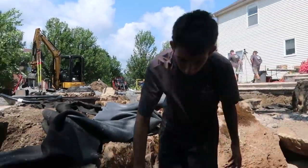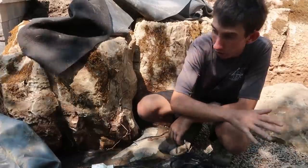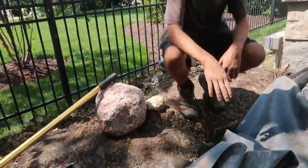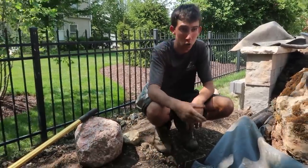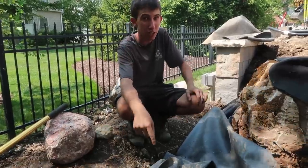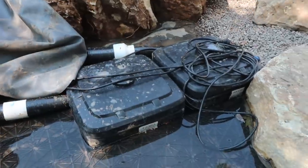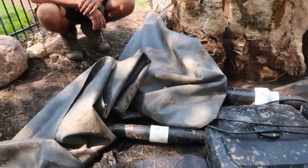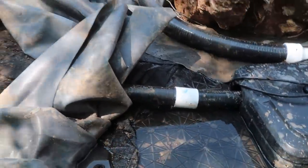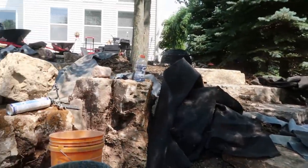Right here you can see our pumps are housed — we have two pondless vaults. We're going to come through here and cobble beach all of this with cobbles and large gravel. Right back here is where the overflow is going to go. We're going to set the water line two inches above the aqua blocks, and that's going to dictate the water line. So when there's big rainstorms, we'll tap off the roof system and all that water will come into the pond. When this basin exceeds 3,000 gallons, it's going to overflow and be able to easily get out. This is going to look incredible — you won't even know where the pump vaults and everything are, where the liner stops and where the land begins.